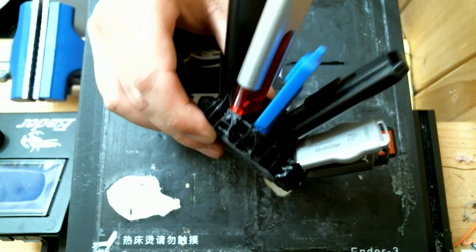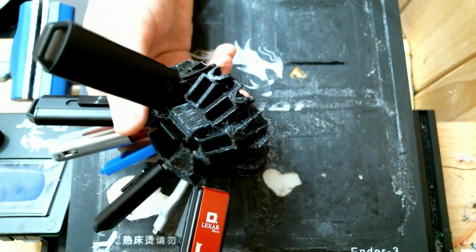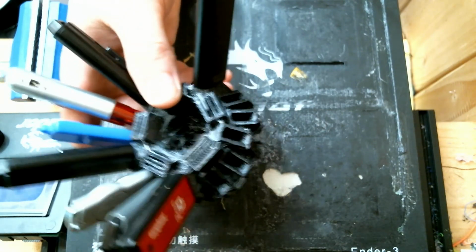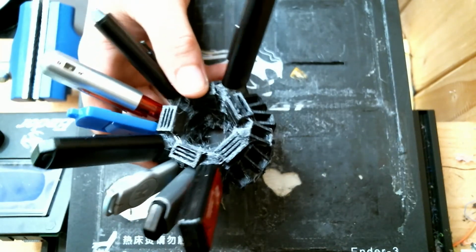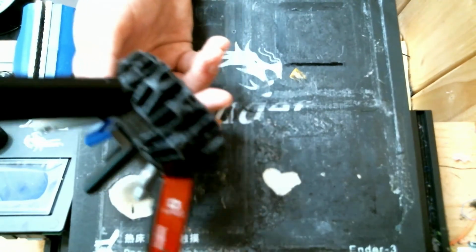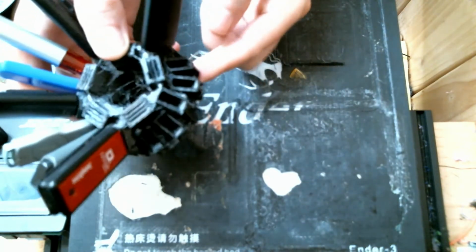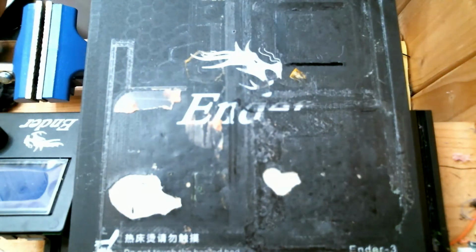So this guy here, the reason why I bring him up, is that this was made at 120% flow. He has a shinier black, and it looks much nicer than the other one. It's a heavier print because it used more filament. Overall, I like the quality much better with this filament at 120% flow than at the standard 100%. So I actually like cranking up the flow. It makes for a better print. Even though this is my final design, as you can see, I've added some supports here and so forth to make sure these guys print nicely, and when it sits on the ground, mostly so this wall wouldn't be so bad, because I'll show you on the other one.